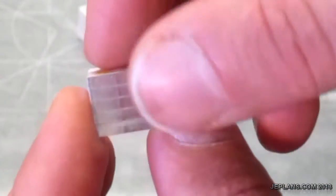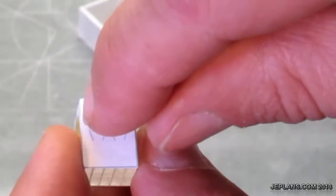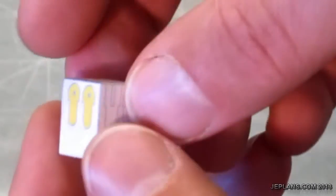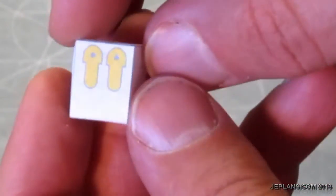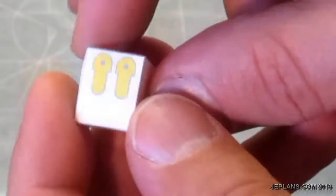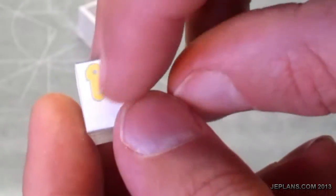This is the pattern on the stacked plastic. I'm going to make these cuts inward on the sides first. I've made it a little wider and thicker than I did on the Mini V8 engine, because the end of the piston is no longer recessing into the piston cylinder, so I can get away with doing that. So I'll drill my holes, make my cuts, and cut it out.